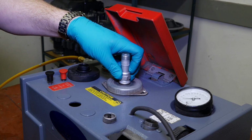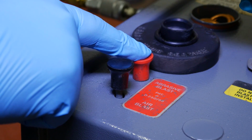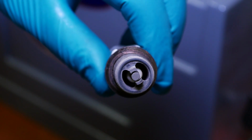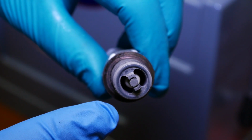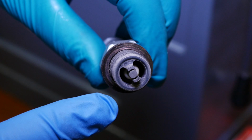Cleaning a spark plug can be beneficial to prolonging its useful life. Many of the tools shown in this video are specific to this purpose of gapping, testing, and cleaning a spark plug. But other methods may be employed. Your local aviation shop or club may be consulted.